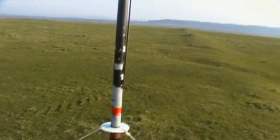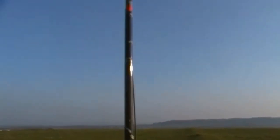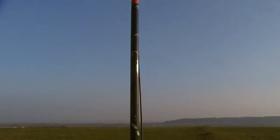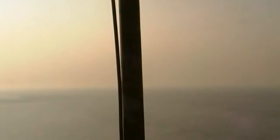I've got the antenna — the very one that I built today — on a 6-metre fibreglass flagpole, stroke rotor pole, stroke fishing pole. I'll just zoom in a little bit so hopefully you can make out where the outer jacket turns into the inner dielectric. It's very sunny so I've actually got a job to see. Hopefully you'll spot it all the way up to the top. I've actually got the top part bent over at 102 inches, so that should be there or thereabouts.